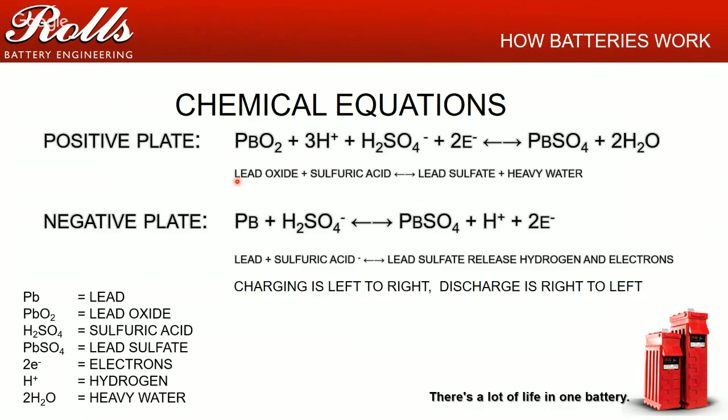So, and that's what a lot of these systems go through. You get customers or clients, especially with an off-grid cabin that's weekend or seasonal use. The battery spends 6 months not being charged, not being cycled. Customers show up in April or May or June, and then they expect the batteries to work like they did in September. That just isn't really the best.